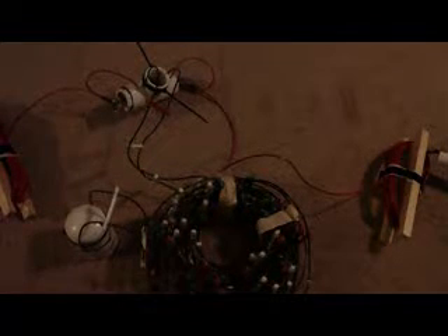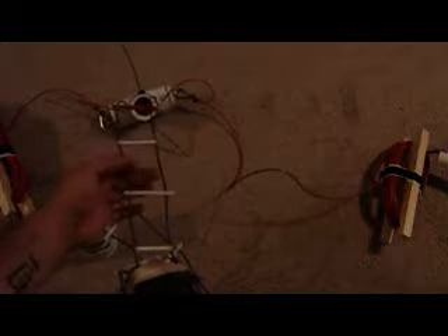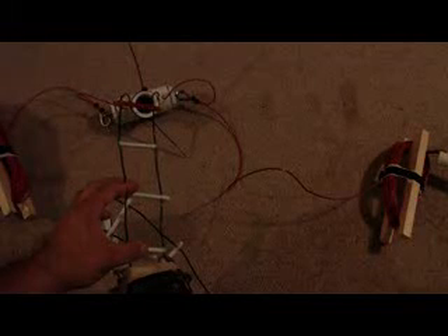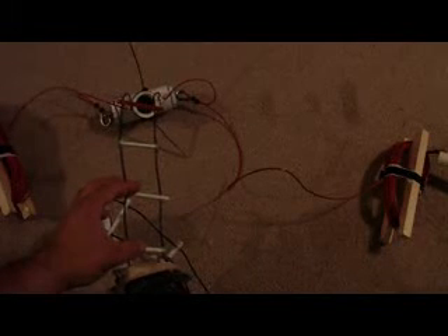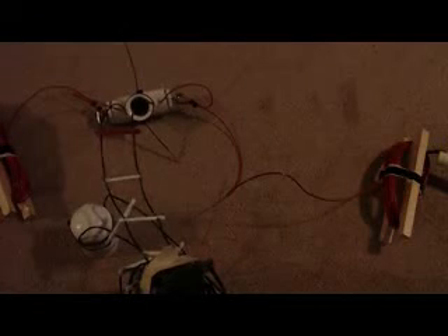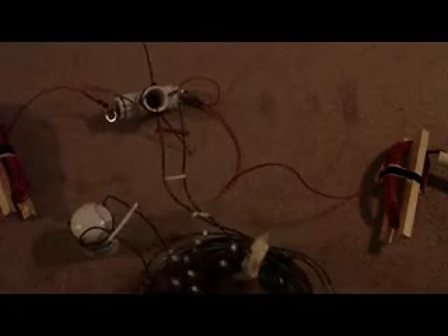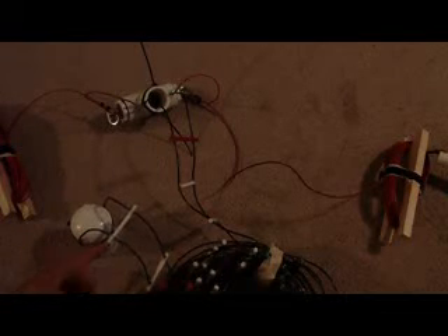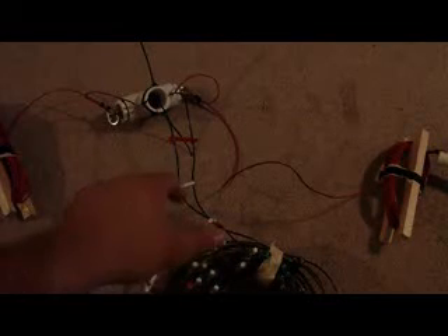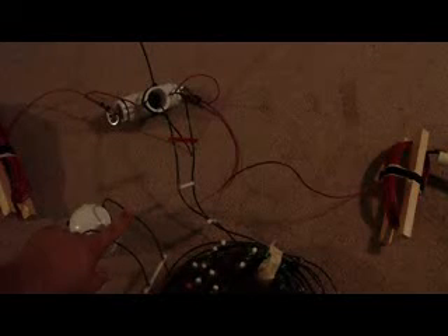The open wire — all I used was these, just like that. It's two inches apart. Each spreader is about four or five inches or so, depending on what you want. I would say don't go more than six because it gets all kind of wobbly looking. I'd probably say like four or five inches. I just used plastic coat hangers, drilled the holes through them, slid them up the two lines to where I need them, and then hot glued them into place.